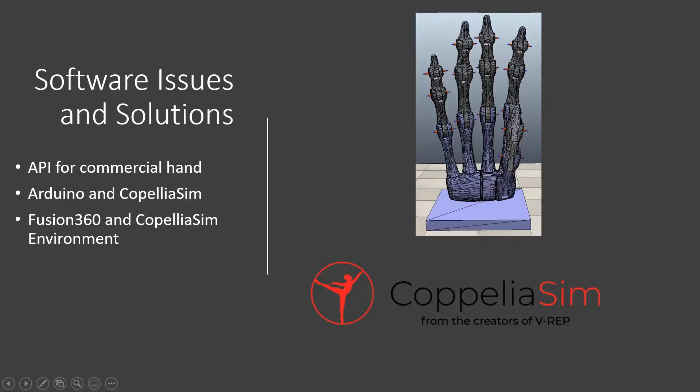The commercial hand bought to initially test the simulation came with two demo Arduino programs: one for reading the flexion of the fingers, and one with Bluetooth and gyroscopic capabilities. The latter wasn't helpful in the scope of the project but could be used in future work. The former was initially used for transferring information from the Arduino to the simulation, using a running average for each finger scaled between 500 and 2500, which didn't work reliably and gave bugs. In the end, any code that came with the glove was discarded and a much simpler program was used.